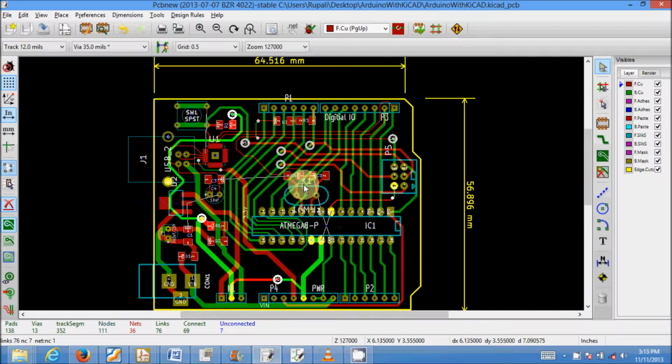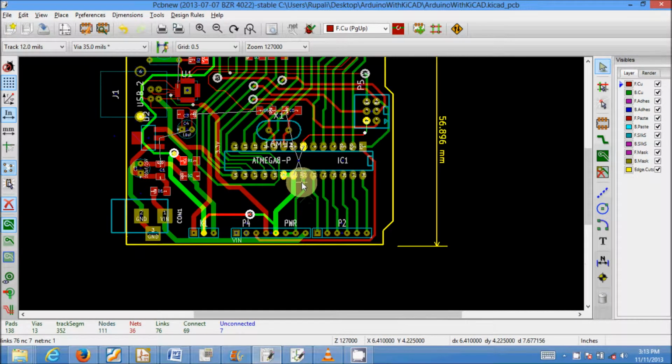They do that to make a natural capacitor. If the top layer is VCC and the bottom layer is ground, with an insulator in between, it makes a natural capacitance. That increases the overall capacitance of the board, which is good for current flow and power.